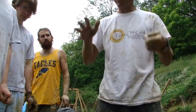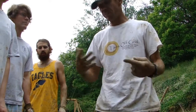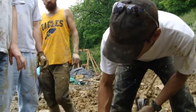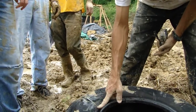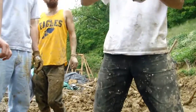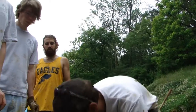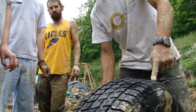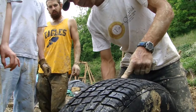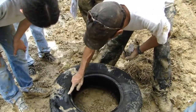This is your best standard first and second course tire. If we were going 10 courses up, we'd use probably two courses of these, then go down to a 225 75 R15 for the next two or three courses, then down to a 215 75 R15, then down to a 205. The tires are just getting smaller and smaller — because 205 is smaller than a 235, that 75 aspect ratio is smaller, so the tires are getting smaller even though the opening stays the same 75 R15.